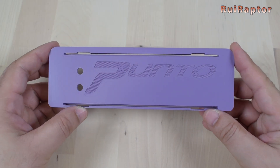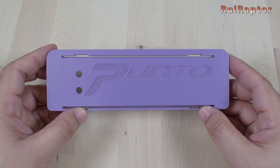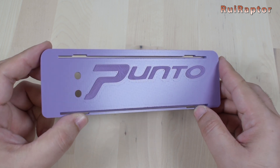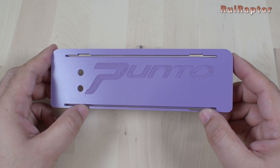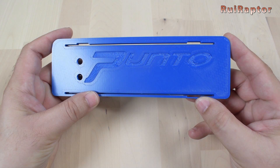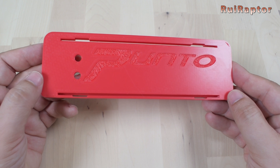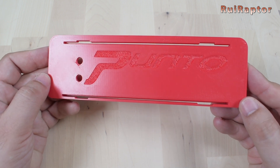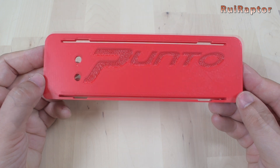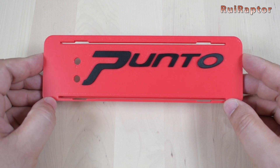For the results for PLA filament, the tests came out all ok. The filament sticks very well during printing and releases from the plate easily at the end. The PETG test print looks smooth and without warping. As for the test print done with ABS, it also looks smooth. However, we detected a very slight warpage on the corners. It's so small that it can be easily fixed with slicer settings.